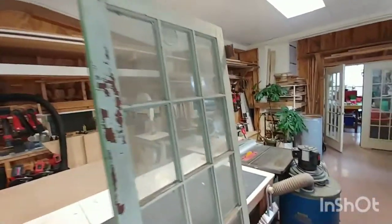and the bottom has some issues with structural integrity, so we won't necessarily have two vertical stiles and the lower rail the way a door normally has. We might cut this right off and add a solid piece horizontally to the whole thing, because getting into the joinery that you need to actually make an extension of this rail that puts it back to good condition is more than I'm willing to do. Anyway, I just wanted to start at the beginning, which is missing glass and stuff.